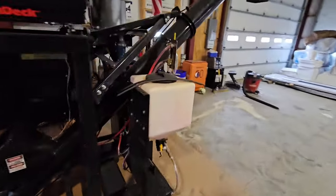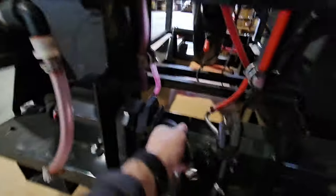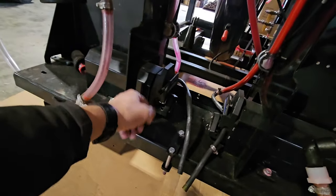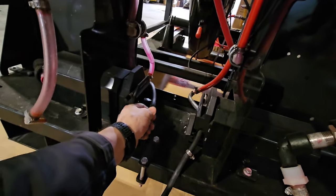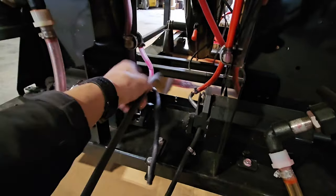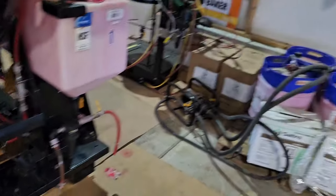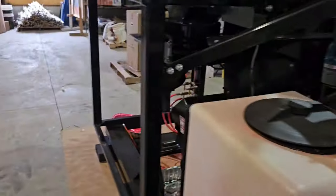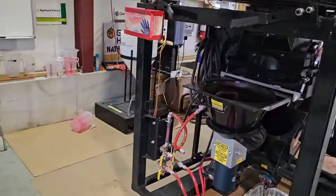I want to change our pump tubes. These two rubber hoses on this peristaltic pump — basically a squeeze pump — can get deformed and worn out. I try to have new ones at the start of every year, so I have a couple of new ones that we need to get installed. I got those hoses changed. We got our pallet of chemical put into place. New pan. Cleaned out the atomizer a little bit more — it was relatively clean.